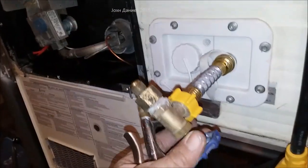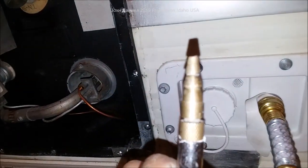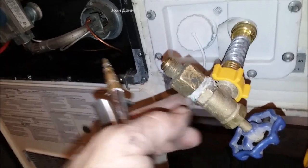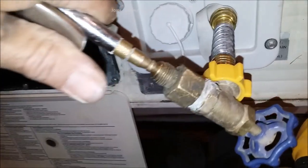Now, you notice that tapered edge on it. I can put it in — what I'm using is a 3/8 gas fitting by half-inch IPS iron pipe — and I'm putting it in there. You can see how that fits. I'll hold that valve there and hit it with air.